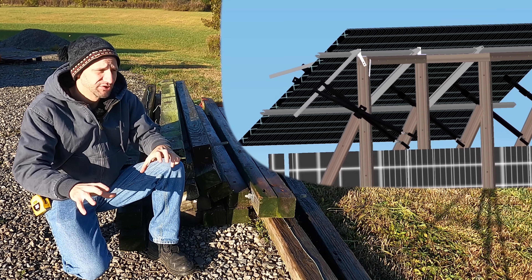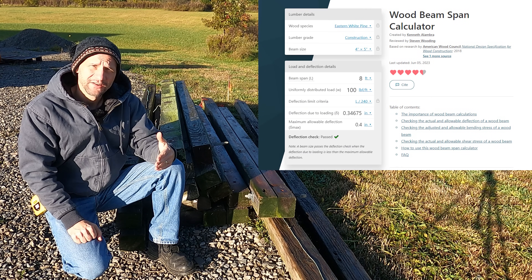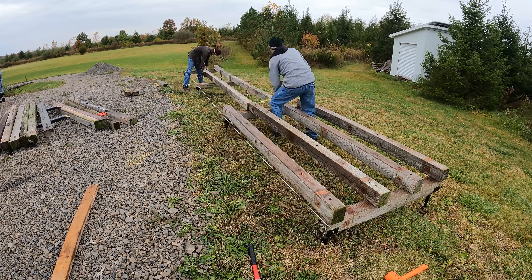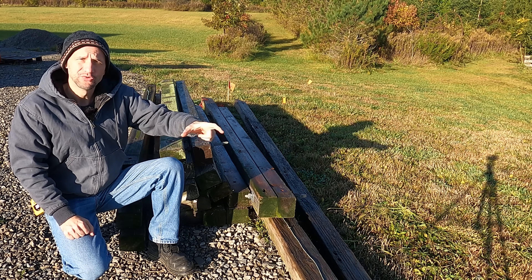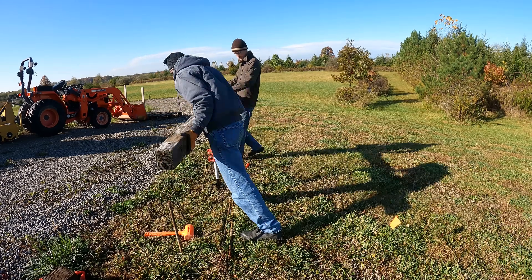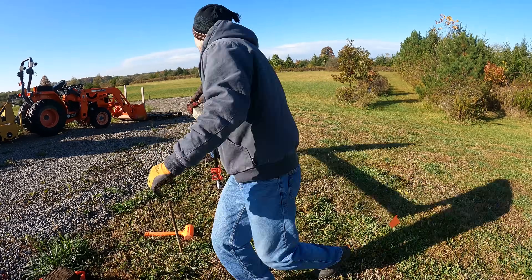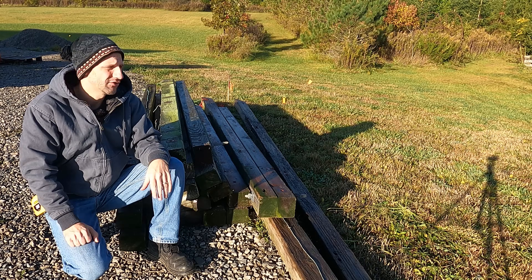However, that uses a lot of my material. Using a beam load deflection calculator online, I determined that if I did four in parallel, that would give me a good floor to carry all of my totes and it would meet the deflection requirements at an eight-foot span. I'm going to put in two screws every eight feet for my 24 feet. Each screw can carry 5,000 pounds, so that will be plenty. The entire rack will hold about three cords, and green wood at 4,000 pounds per cord — we'll have plenty of capacity.